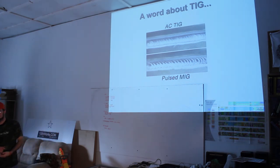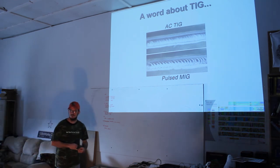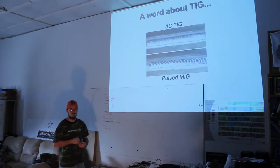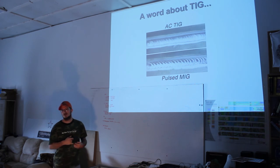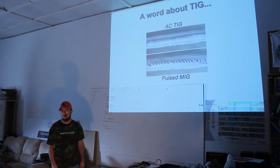What do most manufacturing welds use? TIG, hands down. TIG is pretty much the best, precise-wise. It is. It's expensive. It's particular. A lot of robots, there is a lot of MIG going on in robots. What there's not in manufacturing is gas. And stick: when you need it done right, you send a person out there with a stick, for the heavy-duty stuff.